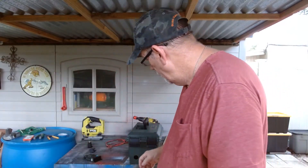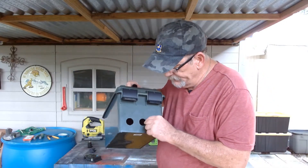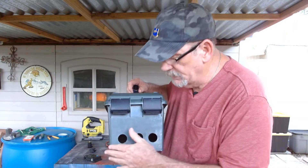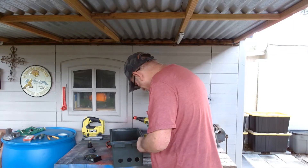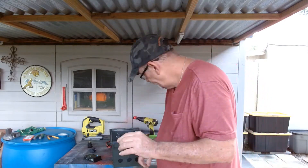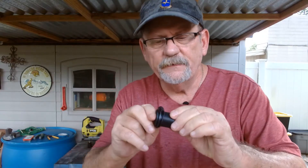As you can see, it's getting a little hot here in Orlando, but we're going to do this project anyway. Here's what your box should look like when you get through drilling your holes. You've got two here that are pretty close together, and you've got one that's kind of offset — that's going to be the input from the solar panel. Once you get these cut, you can put your sockets in there. We're going with a regular 12-volt socket here. These come with washers and caps — it makes them waterproof — so you can actually take this camping with you.